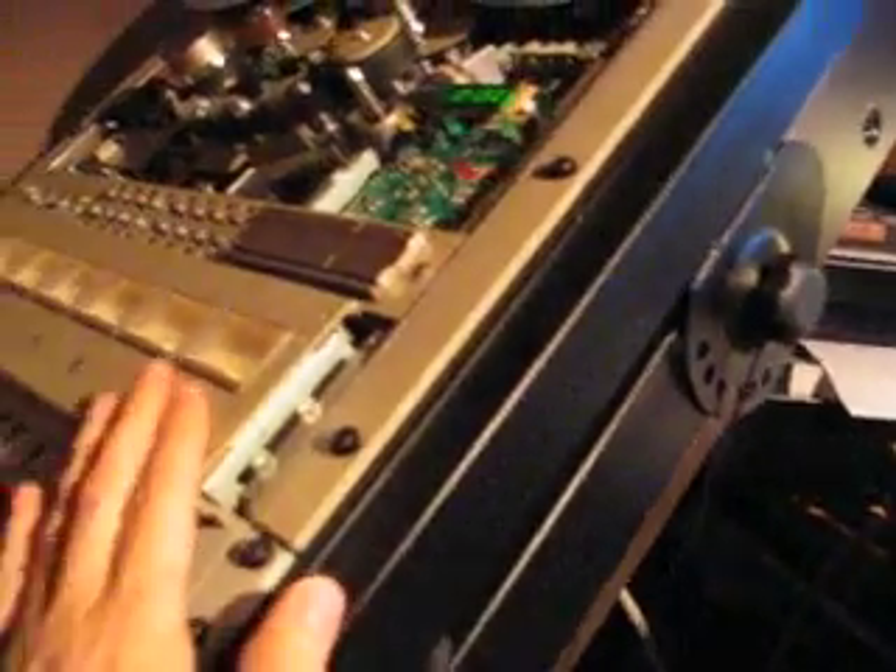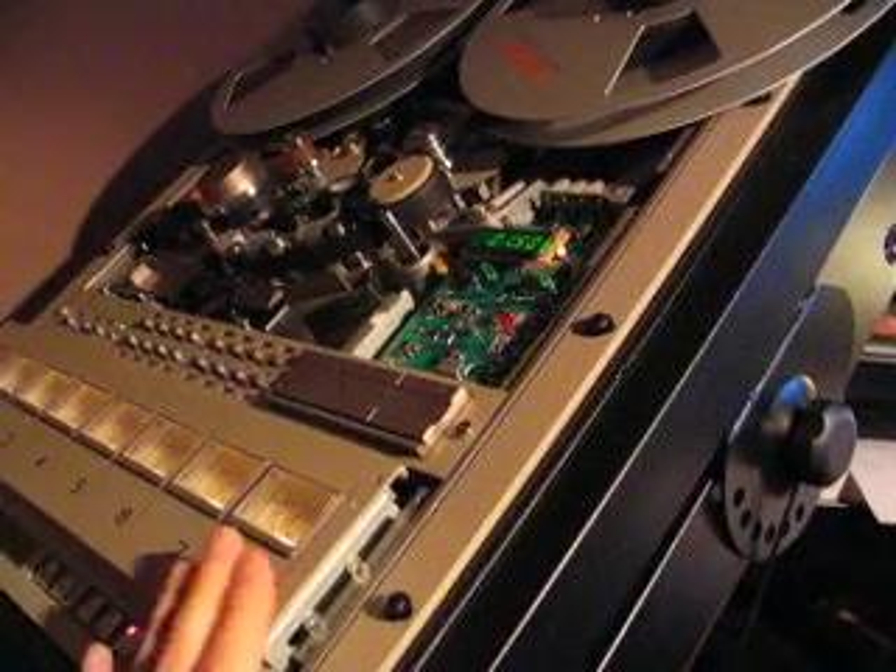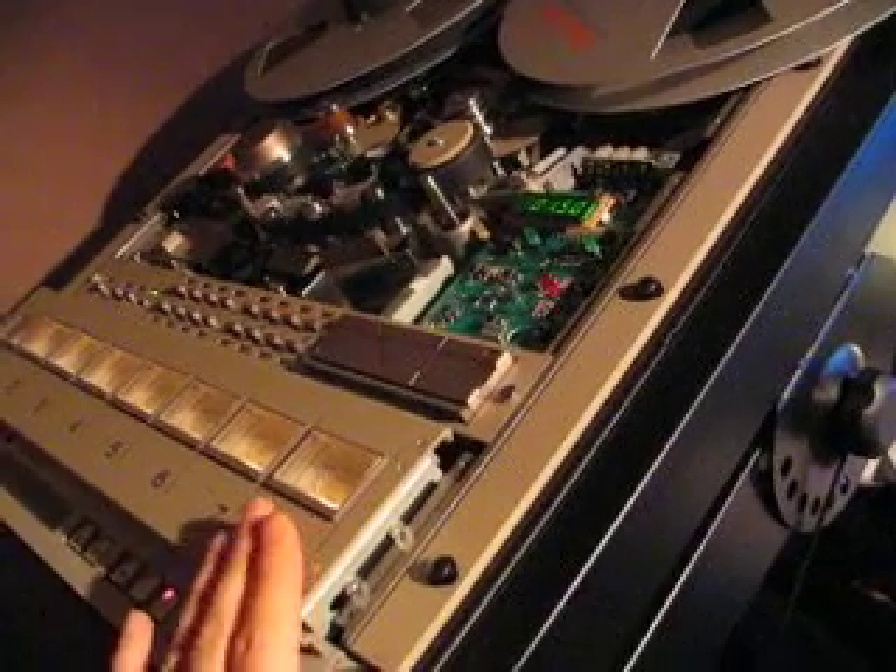For simplicity's sake, I striped the track of SMPTE code on the 58 at about minus 10 VU, and I'm just playing back straight out of the 58. I have that patched through here to the slave timecode in on the back of the ES50.